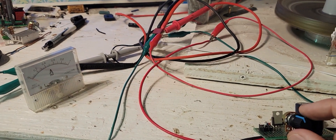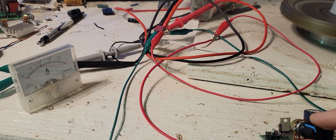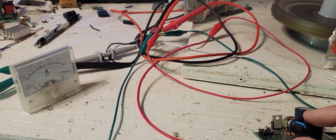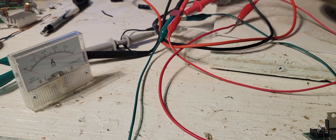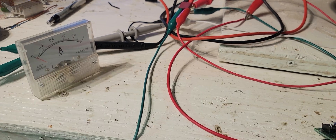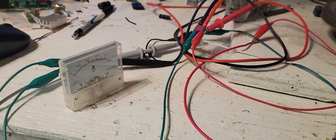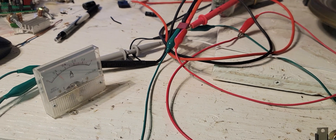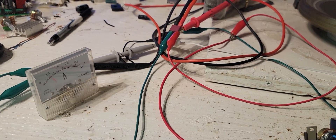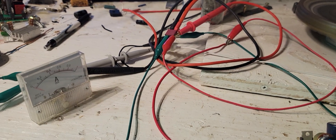Just keep turning it down enough to where it kicks on - there you go. So yeah, it gives you quite a bit more flexibility with these circuits with the Zener diodes. They're good because they're really simple - it can't get much simpler than that. You've got a potentiometer, a diode, an SCR, and a capacitor. You don't want to have too big of capacitors either, because if you want to fire at a higher voltage you spend a lot of time trying to get there and you're not using a lot of input power.